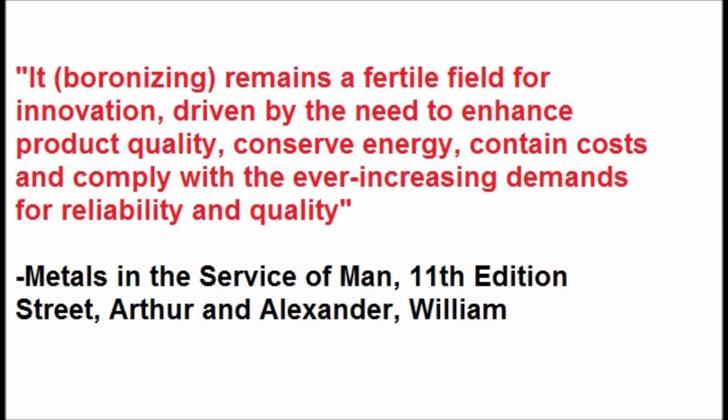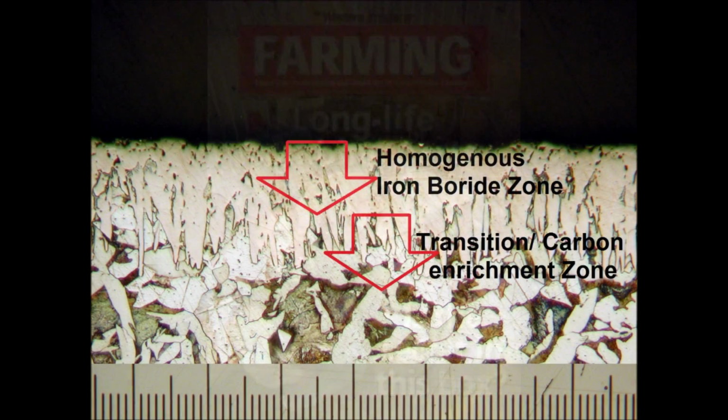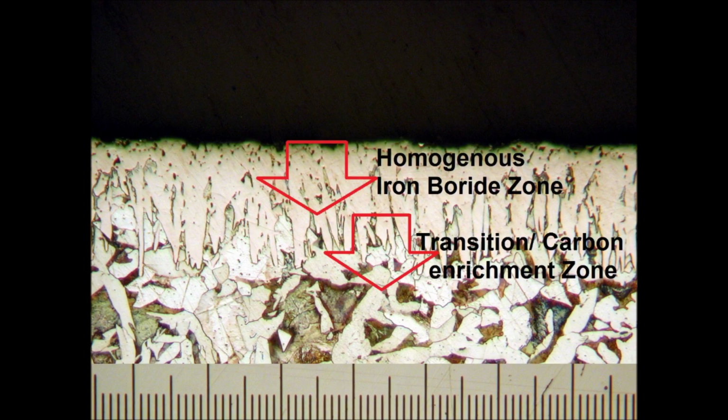About 20 years ago, we got into the development of the fundamental chemistry of thermochemical boronizing. Most people, when you begin discussing the subject, mistake it as an alloy, mistake it as something other than what it is. Boronizing is a reaction to the iron on the surface of a part. We take boron and we free it up with an activator, and we react it with the iron, and what we want to form is a layer of iron boride, or Fe2B, on the surface.